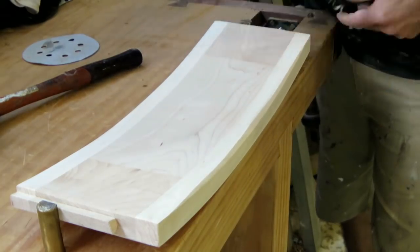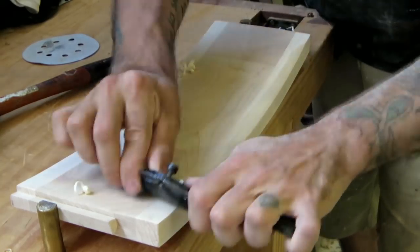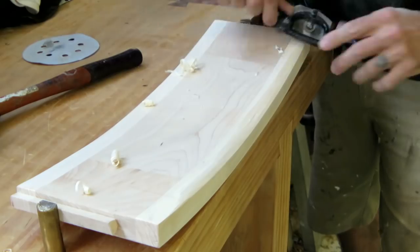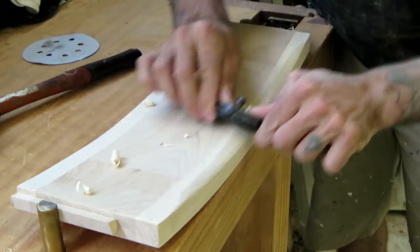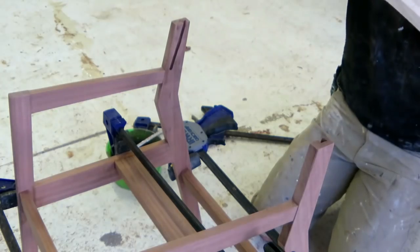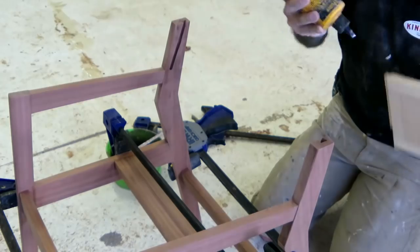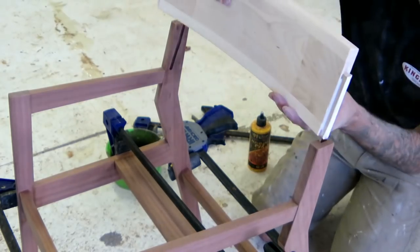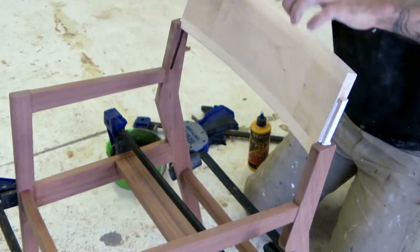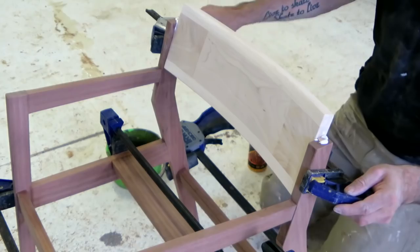So the spoke shaving of the back was something I wanted to actually avoid because there's too much inconsistency. It's very difficult to do this evenly and speedily across a range of chairs, so I'll do something slightly different later on. Also, it occurred to me afterwards that these really only need a very small amount of glue, probably at the bottom, because they're a mechanical joint, and it also lets the timber expand upwards as well.